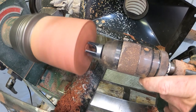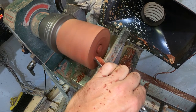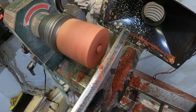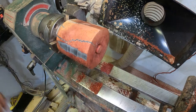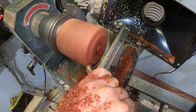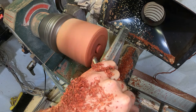And here you'll see this is a wood plug cutter. The kit that I got's got a 13mm and 16mm, so I got the corresponding drill bit that way the wood plug fits perfectly inside. So you got a 13mm wood plug, you got a 13mm drill bit. And I'm just test fitting to make sure everything fits up just fine. And once I finally get everything cut down, I'll concave it. That way it sits just right on there, not too much, not too little.